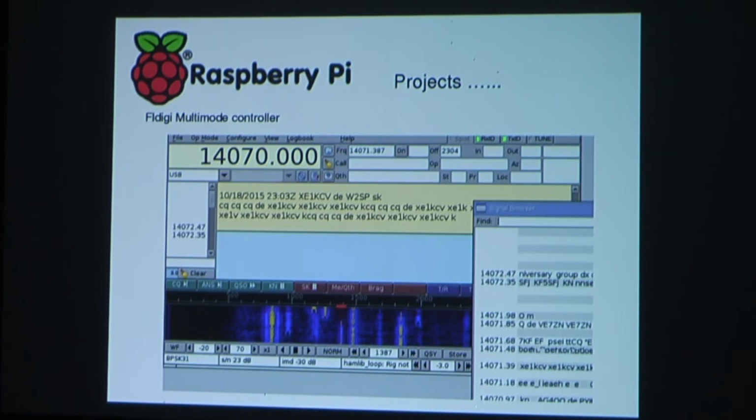Now I'll give you this. The sound that comes out of the Raspberry Pis is a little hissy, a little white noisy. It's because they don't have an onboard dedicated DAC to make the sound. What they actually do is they take two of the GPIO pins coming out of the Broadcom system on a chip, which aren't broken out to the 40 pins, and they pulse width modulate them at 50 megahertz, which basically sends an FM out for each channel at 50 megahertz. They demodulate the FM and run it through a few RC filters. It works, it gets your sound out, but it's a little hissy and it's not the best quality,